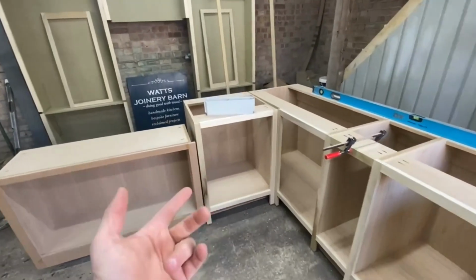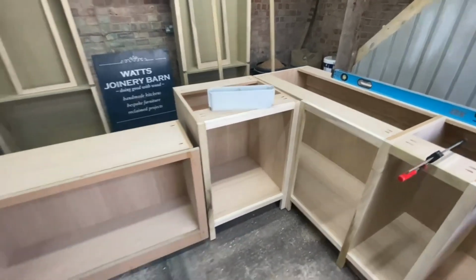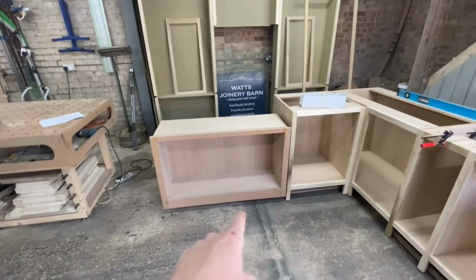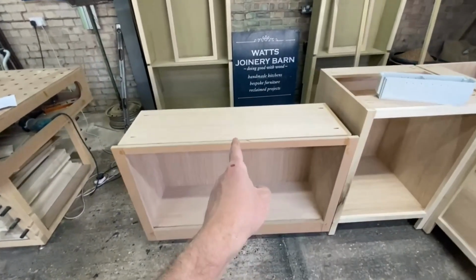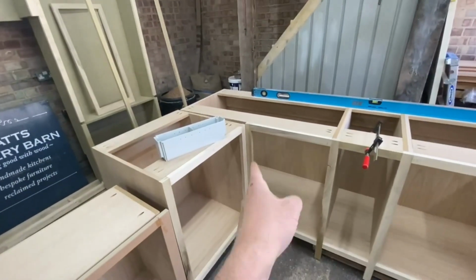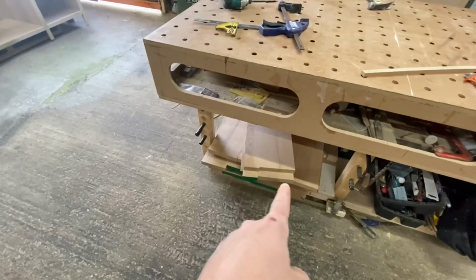But again, although I know, because I've done my presets on my domino, I just couldn't order the right hinge for that. That's that other alcove unit. Again, just a dry run. I've just got a couple of things to do. I've got to put a middle brace in that cupboard as well. But I actually do those in solid oak because by the time you put a piece of veneer board in and lip it, you might as well run off solid oak. And I shall get that from the offcuts of these shelves because some of those shelves are probably about 50, 60 mil too big. So that'll be perfect.